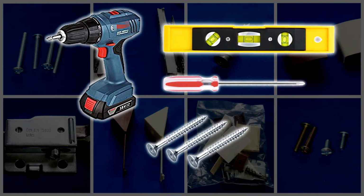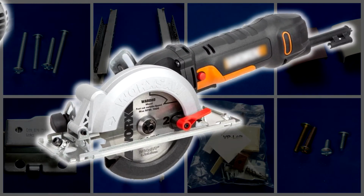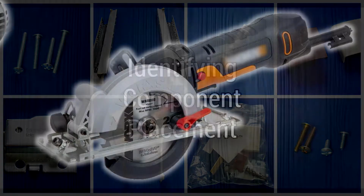In addition to the included hardware, you will also need some additional tools like a screwdriver, level, power drill, and some 2.5-inch screws to fasten the side panels and rail to the wall. Hanging rails may also need to be cut, so you will need a tool such as a circular saw with a metal cutting blade, or an angle grinder or multi-tool equipped with a metal cutting wheel. If your closet has corner connecting shelves, you will need to cut these down to size using a circular saw.